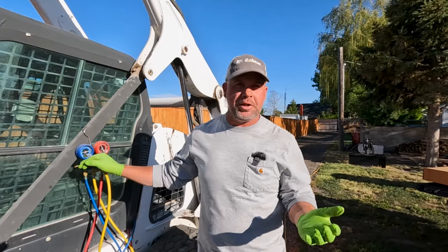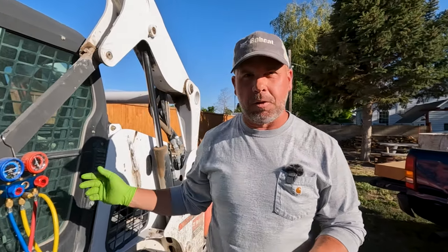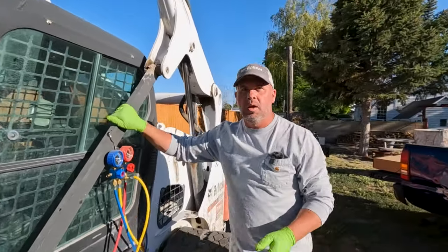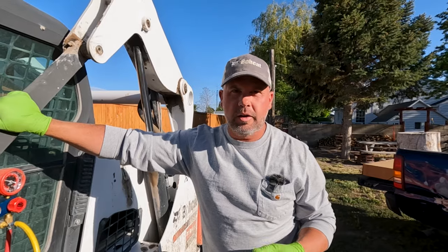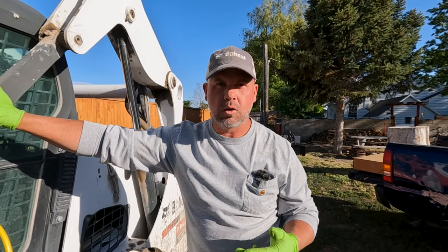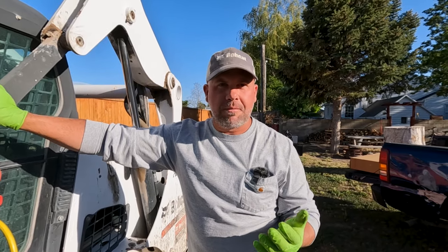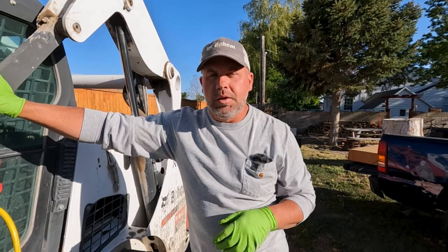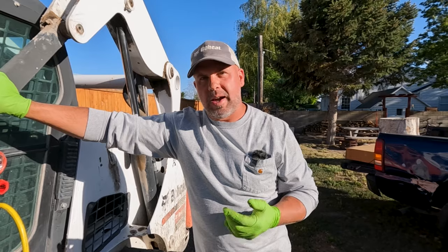A lot of customers just say, "Can you come out and put some Freon in there because it's not cold?" And again, like I said, it's a lack of airflow on these machines. It's hard to go over every possible scenario why your air conditioning on your Bobcat won't work, but hopefully that gives you kind of a general idea of what to check for: airflow, filters, cleaner coils. I showed you where the thermostat is and the thermostat flash codes. You can find the flash codes at mcc.com — it's Mobile Climate Control out of Canada. They've got a lot of manuals on there, and it's also in your Bobcat service manual. If you have any questions on the air conditioning systems on your Bobcat, please let me know. It's kind of hard to troubleshoot when you're not there and you don't have the right gauges, but I'll do anything I can to help. Thanks for watching.